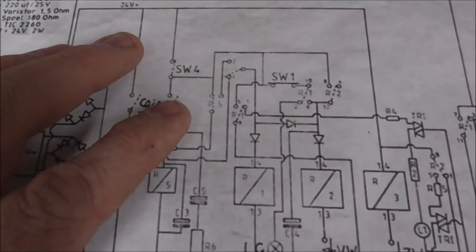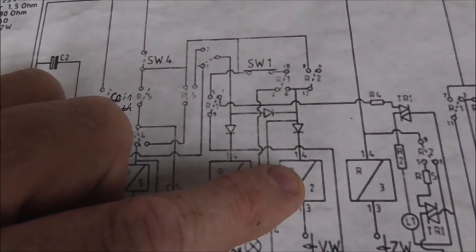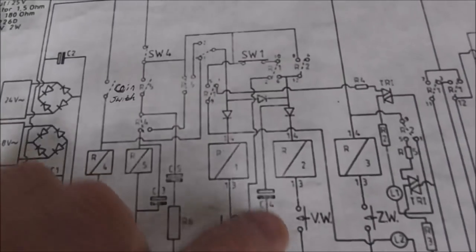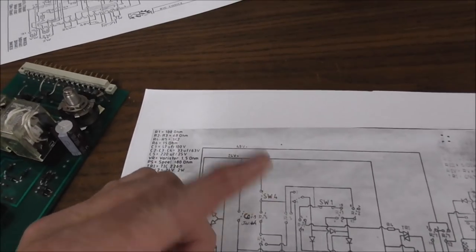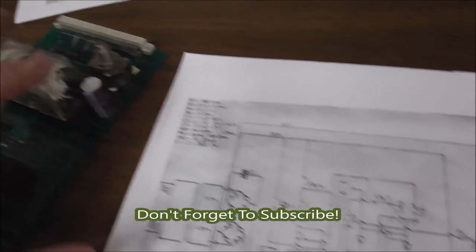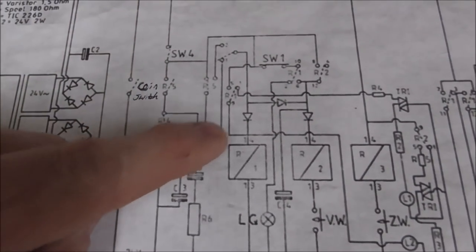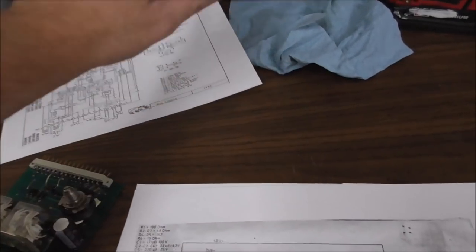So relay one is working swimmingly, but it's also supposed to turn on relay two. Relay two should be turned on so that if you hit the button, it moves, but it doesn't. So why is that? After testing and testing, by the way, when I was hitting the coin switch, we were hearing the coin meter go up. It wasn't the relay turning on and off. Relay one was holding on. If I hit this button, nothing happens. But if I hold down the coin switch, that keeps power constantly going to relay one and relay two. Then when I hit the button, the trolley moves.